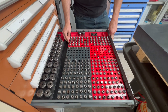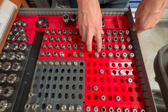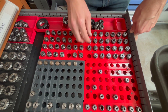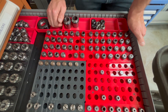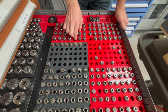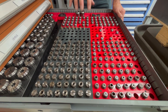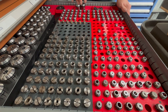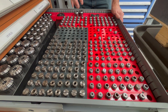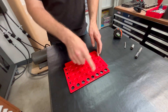The other sizes of racks we're going to be making are the rest of the ER series. We've started working on the ER-20s, and we're going to go up to the ER-25, ER-32, ER-40, and ER-50 as well. There will be a different number of collets in each rack, but it will be the same profile size. So it will be modular to fit in your drawers the same way, no matter how many different kinds or sizes of collets that you have. The overall rack size is 8½ by 5½ inches.